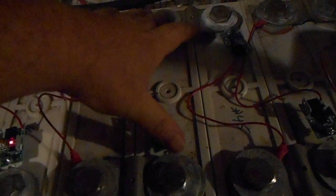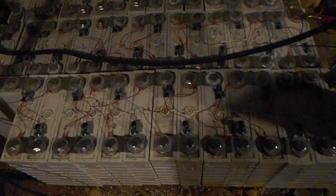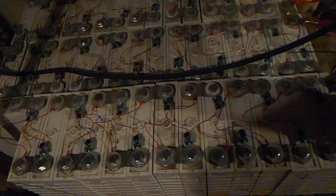These are each 300 amp-hour batteries, so there's a total of 900 amp-hours here at 48 volts. For those unfamiliar with lithium-ion batteries, there's a little blinking circuit board on top of each battery that keeps them in balance. Each cell has a maximum of 3.6 volts; 16 cells times 3 volts nominal equals 48 volts. When they're down to 3 volts I consider them fully discharged — they can go to about 2.4 volts but there's very little usable power left and it's damaging to the cells.